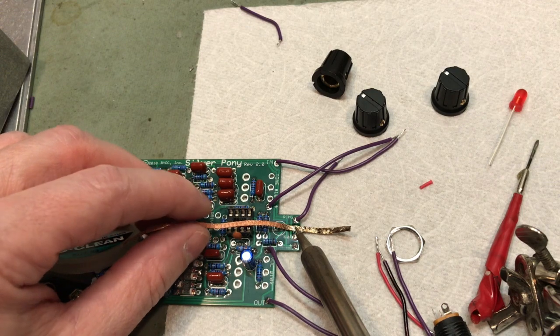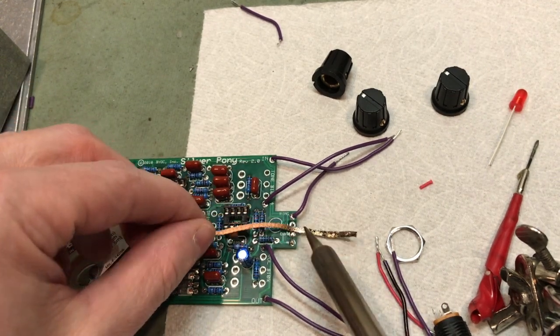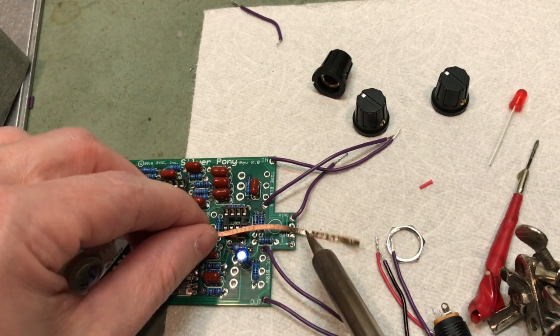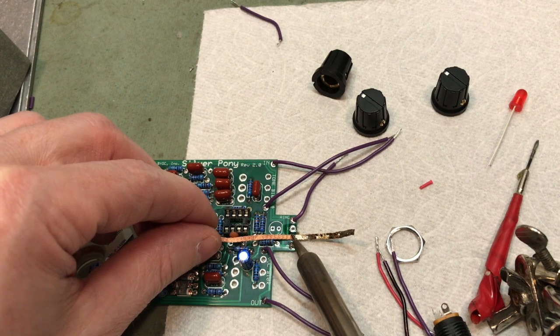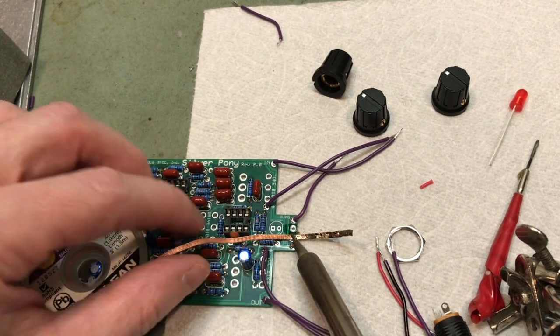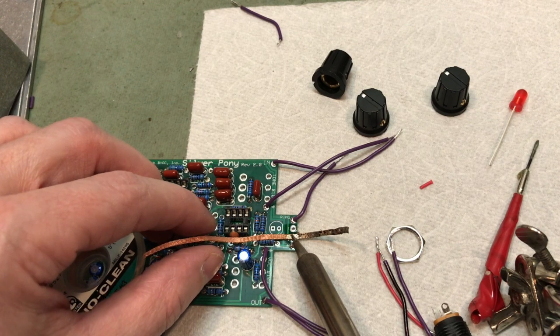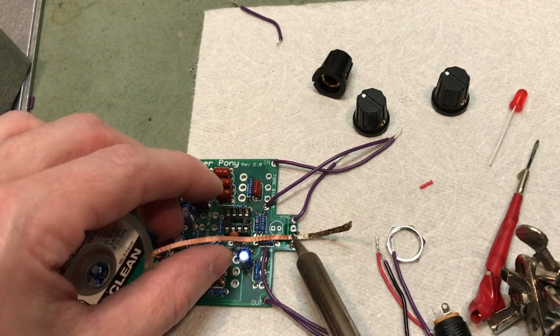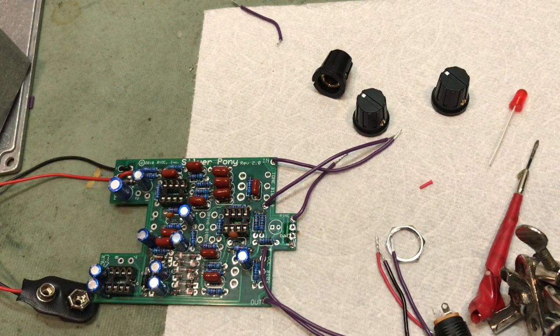That's what you're really adding is flux, which makes solder flow much easier. So you've got a little flux on the braid already. If you get real lucky, you just go on to the next one. Ooh. And wick that solder right out of there. See it wicking up through the solder braid there? When solder starts flowing, it's like magic.